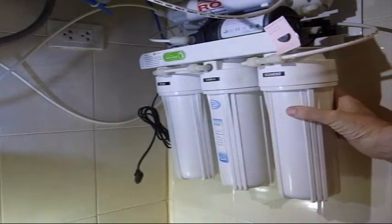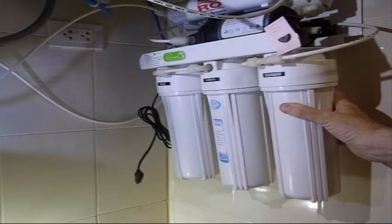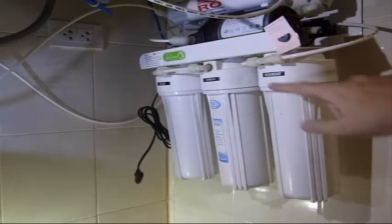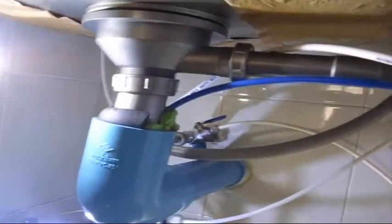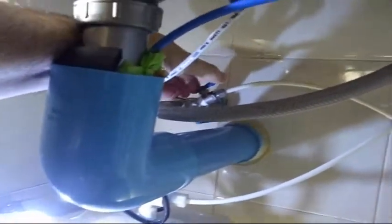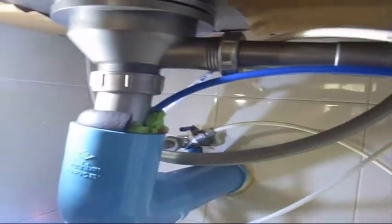You can tell what they are when you take them out: the sediment filter looks like an ordinary filter, the carbon will be very black, and the resin will be a light brown color. If yours aren't marked, use a permanent marker to label them. Now I need to shut off the water — on this one the shut-off is this little blue valve right here, which you turn 90 degrees.